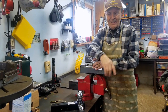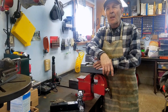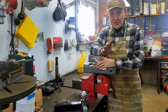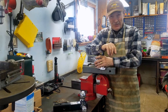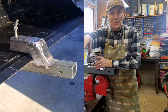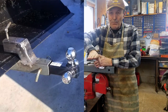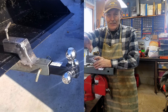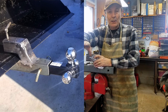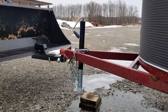So I decided I needed to make something to make moving our trailers easier. What I have here is a bucket trailer hitch — it goes onto the bucket of the tractor on the front. Having it on the front is nice because I can see what's happening. I can drive the tractor up to the trailer, bring the ball up underneath the hitch on the trailer in exactly the right spot, and then lift the trailer up with the bucket, which is very strong.